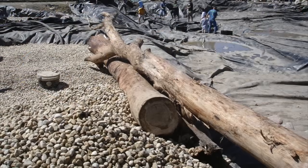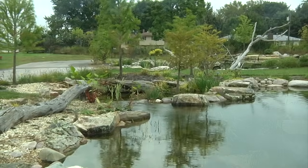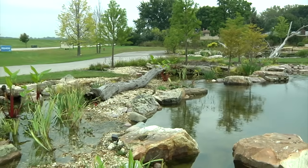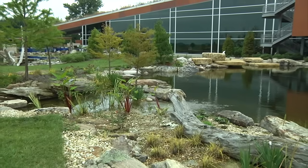So we have three distinct layers of gravel. Dirty water comes in, flows up through all these gravel layers, and then we place aquatic plants directly into the gravel layer. All the roots extend down into that gravel layer, and they further remove nutrients that build up inside of the wetland.